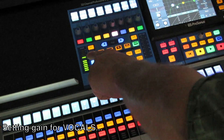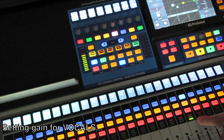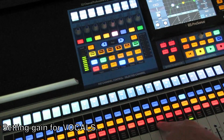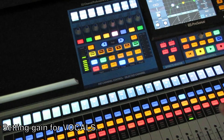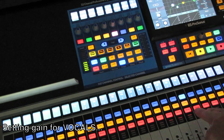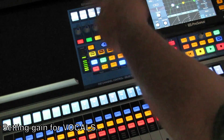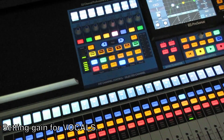If you compare this peaking level here to what's going on down here, you don't see another light taking place with it. The lights at the top of the faders are very good — they'll tell you what's going on. But some people can be confused thinking that there's a green light here and another green light above it, so green must be good. But not necessarily, because you're actually approaching the limits of what the board can produce for gain.